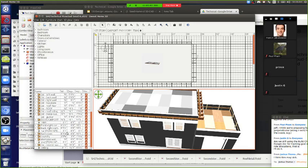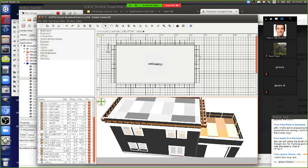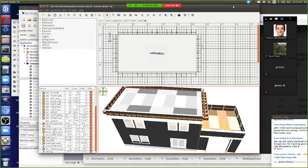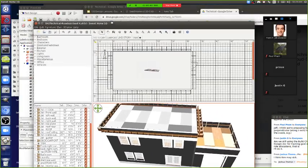Marcin, what's the R value of the walls? I think that's like 21. So whatever 6-inch insulation is, the standard 2x6 insulation from the store. I think that this might not be enough for upstate New York where I am. Not sure about that. I would need the R value of 25, divided as R20 in the wall cavities plus R5 of continuous insulation on the exterior wall.